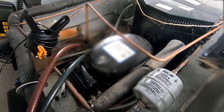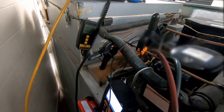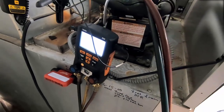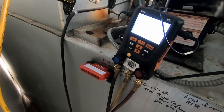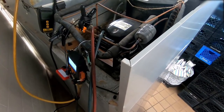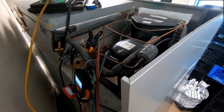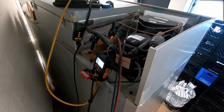It's going to have to stack in the condenser coil. This comes down to experience - that's why I usually pull the charge and weigh it in, but I'm keeping track of what I have. So far we're at 10 ounces out of 20, got a 7-degree subcooling. Head pressure is running 106 degrees and it's probably 74 in here - so about 30 to 32 over ambient, right in that ballpark. Superheat is not anything to brag about, which doesn't surprise me a whole lot. Basically this thing's got a refrigerant leak - it's had a lot of work done over the years: compressors, TXVs, start components. But the box is in really good condition because this is a cafeteria and the same people always work with it, so it's not abused and it lasts quite a while.